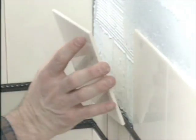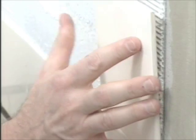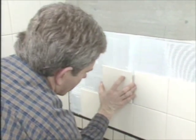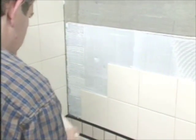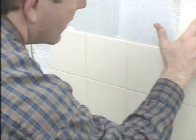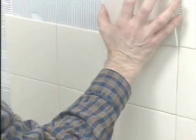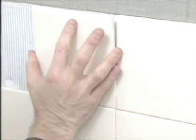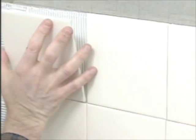The adhesive is fairly sticky and the tiles don't weigh that much, so we simply press the tiles onto the adhesive and they pretty much just hang on the side of the wall. We're using six-by-six tiles; four-by-four tiles are also a real common size to use in a bath surround. There are little lugs on the edge of the tile — you place one tile up against the next and those little lugs perform the spacing function, so we don't have to worry about keeping the tiles a certain distance apart.